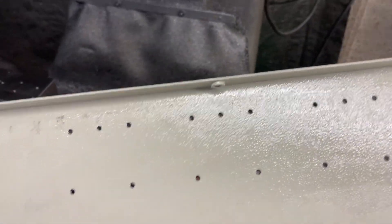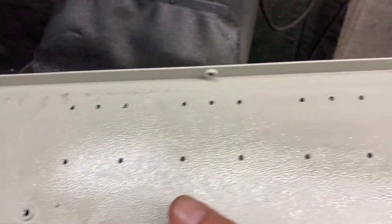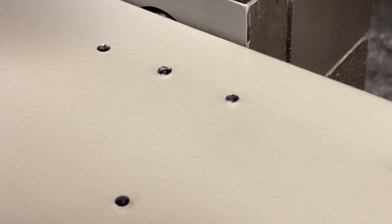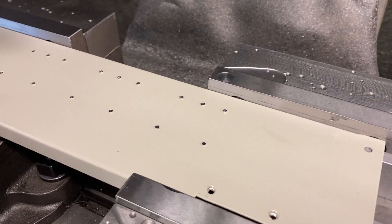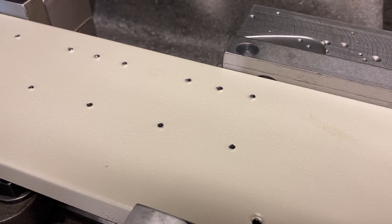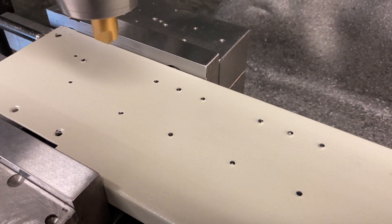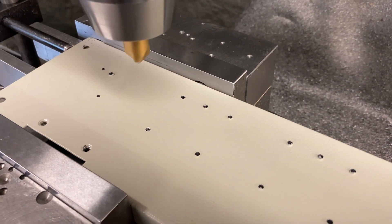I center drilled and tap drilled them all. But if you want a recipe for disaster for breaking your 6-32 tap, go ahead and tap those parts without deburring the backside — I'd be surprised if you get through all those holes without breaking the tap off. 6-32s are a little funky as it is, but when they come through that other side and grab that burr, snap-a-roo, they break right off. Not all the time, but more times than you'd like.